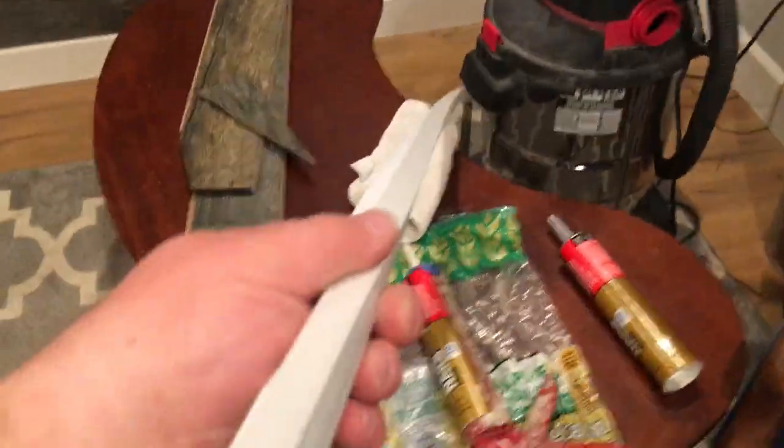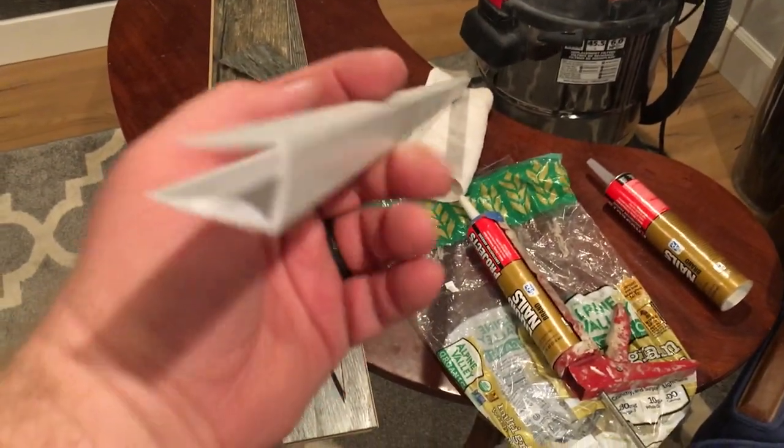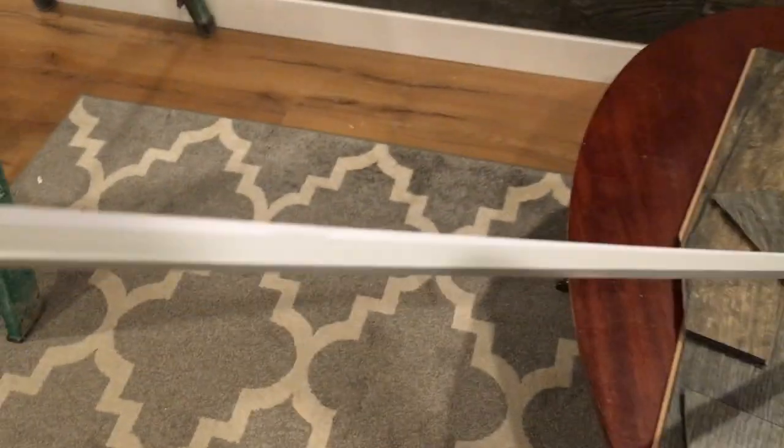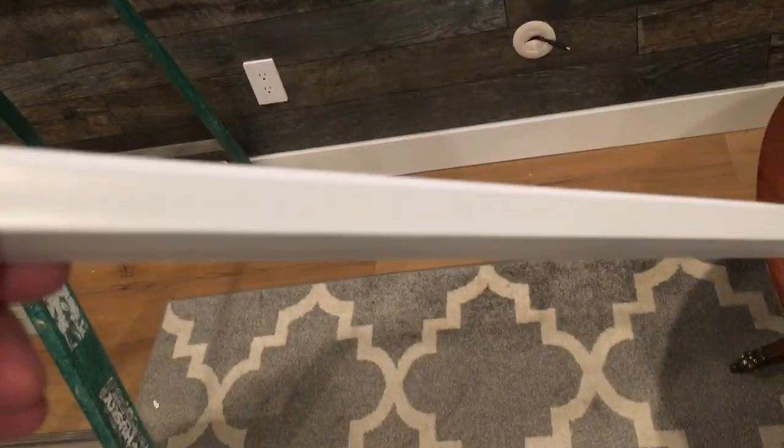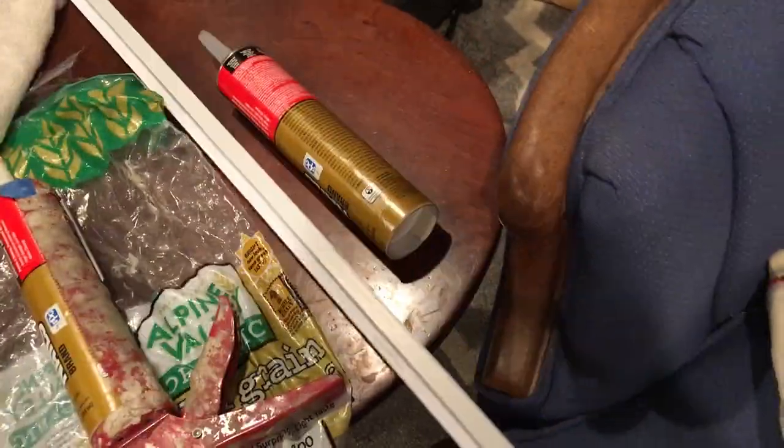Here's what the J-trim looks like uninstalled. I've got my corner mitered — it's just this piece. They make it in metal, but I wanted it in PVC so I could paint it. You can see it comes white, and I put a coat of gray on it. It just goes over that edge. I couldn't figure out how to trim it out nicely, and then a neighbor suggested that to me.